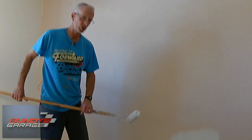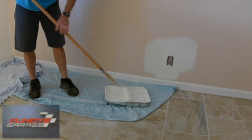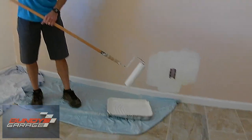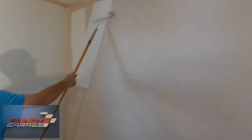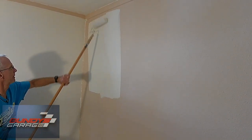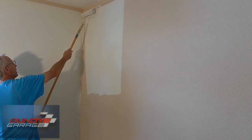If we're rolling, we want to make sure you get a lot of product on your roller, whether it's a paintbrush or a roller. I just gently saturate it and then roll it back across those ribs. And it might drip a little bit — the thing's completely full. What I'm doing is getting most of the material paint on the wall, and then I can come back and kind of fill in, pushing that paint back into the wall, spreading it out so it's consistent, because we know it was much heavier where I initially touched the wall.